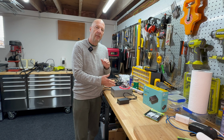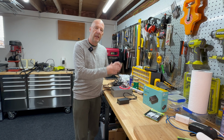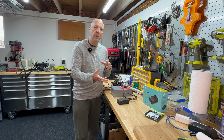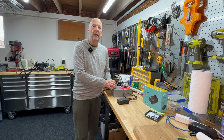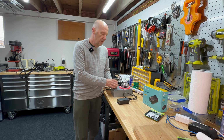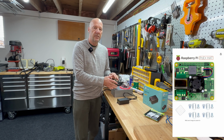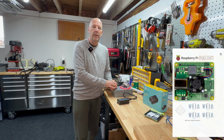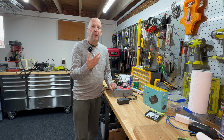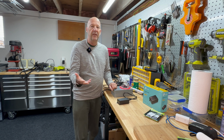And I don't know whether that would be enough to run the whole thing, the Pi and the camera and everything fine. I know when I was using a USB charger, like for the phone, that was outputting 2.5 amps, it struggled a bit. This new one, that they updated in 2021, is the Pi Hat. It's PoE plus, so it's got a plus on it because it has extra power, so it'll give you 25 watts of power output, so basically 5 volt 5 amp effectively.